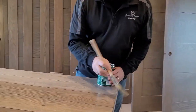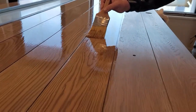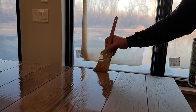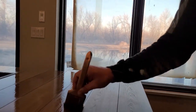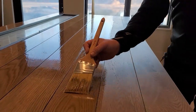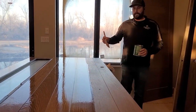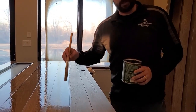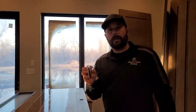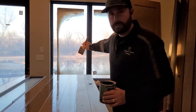But now, the key to making this look really nice, and I'll have Jose kind of follow me, is you do one nice, kind of firm stroke. I'm probably putting a couple, maybe a pound or two of pressure on the brush itself. And what I'm doing is I'm taking all those brush marks and I am making them one. So this way, especially if your door is laying down, that brush mark will all self-level, especially because it's flat. But when you get done with the door and it all dries, you won't see a bunch of brush marks. And I know, like me, brush marks drive me crazy. So this is one little trick. Alrighty? So yeah, that's about it. Just make sure you finish each pass with one solid brush stroke from top to bottom.